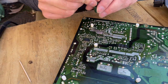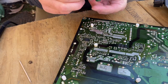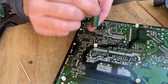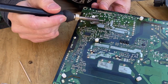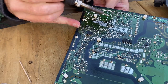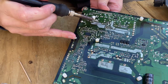When I put this capacitor on the other side of the board and heat up the leg closest to you, I'm actually pulling away on the other side. Then when I heat up the front leg, I shove it. So I'm basically rocking it back and forth. You'll see how quickly and simply it comes out once the solder melts. I've got one side out — and that side out. And we're done.